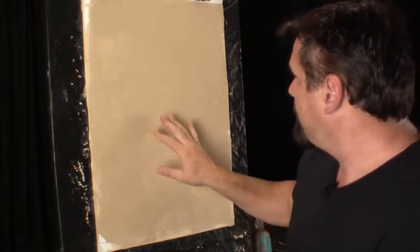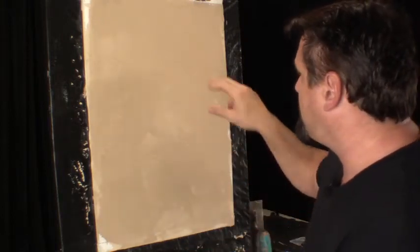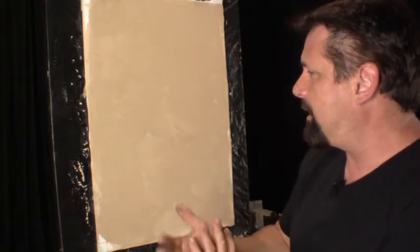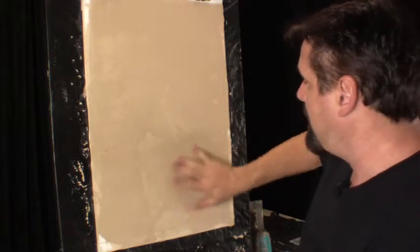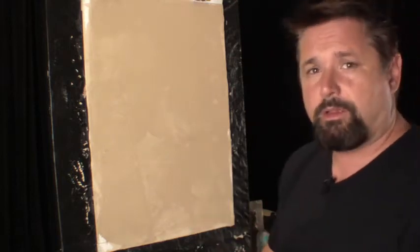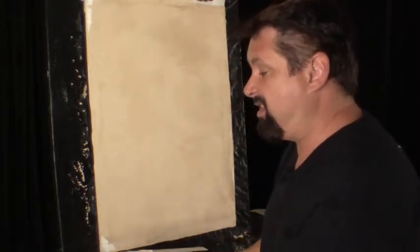You can start to see it dry. I'm going to do a third coat because I can still see some of my base white showing through, and I want a nice even, fairly uniform color — soft khaki with no primer peeking through, so that means I need one more coat. It's almost dry; it does dry kind of quickly. I'm not going to put a lot of pressure on it because I could damage it. Third and final coat — I'm going to apply it very thin and tight. No sanding in between coats; I prefer not to sand because lime dust becomes airborne and gets into the ventilation system. If you take your time and use the right technique, there's no need to sand at all.